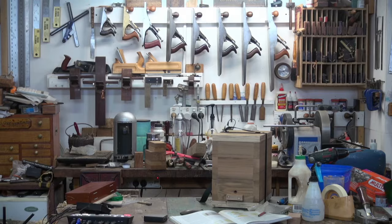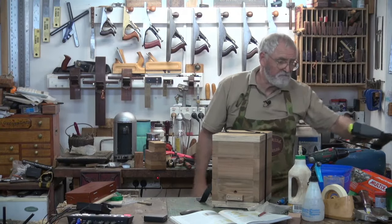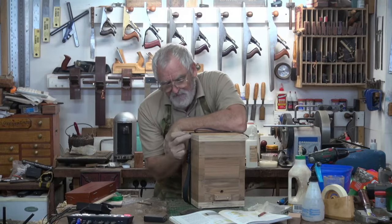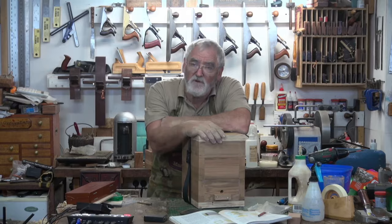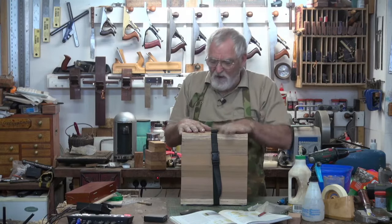The biggest problem with timber, as I mentioned at the very beginning of the stream, when we were sizing those edges to butt join them, is the end grain. Now I understand if you are using pine or something, and a lot of people do, they paint the entire thing, and that's fine. If you're using internal plywood like this is, definitely paint it with a good quality outside enamel paint or acrylic paint, because you don't want the weather getting to it.